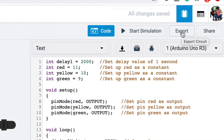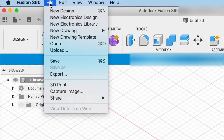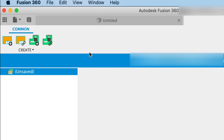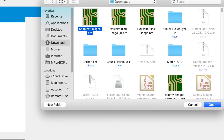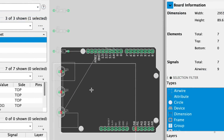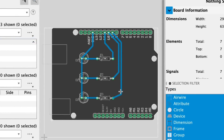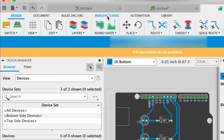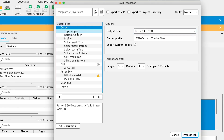Here's where it gets really interesting. In Tinkercad you can export the circuit — you're exporting the Eagle .brd file, or circuit board layout file. I can download this and then open Fusion 360, another tool, and say new electronic design. I click on the icon to bring in the board file, select the one I downloaded from Tinkercad, and there it is: the board layout for a shield, all the components, the rat's nest showing the connections. I place the components where I want them on the shield, lay the traces to make the connections, then move from design to manufacturing in Fusion 360 using the CAM processor, which produces all the files in RS274x Gerber format — the top layer, bottom layer, drill file, everything I need. I click on export as .zip and download that file.